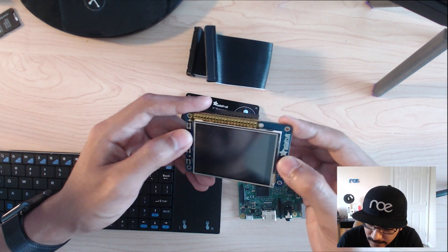The next thing I'm going to do is go to the easy install portion of the Adafruit Pi TFT — the 2.8 touchscreen display for the Raspberry Pi 3. Scroll down to where it says DIY installer script. The first thing we need to do is expand the file system, so I can do that with sudo raspi-config. I'll expand the file system, hit OK, go to finish and it'll ask if I want to reboot — I'll say yes. You can see it's rebooting.